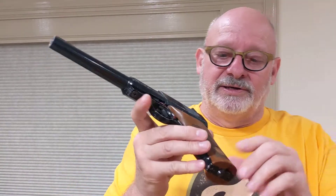When the laser beam hit the 3D printed plastic, the entire assembly started glowing. I realized I could embed just one optical sensor inside that piece of plastic, and if the laser hit anywhere on it, it would detect it. Before, I was thinking I'd need an array of sensors, and wasn't sure I even wanted to pursue that — but once I saw how it reacted, it gave me a whole new direction.